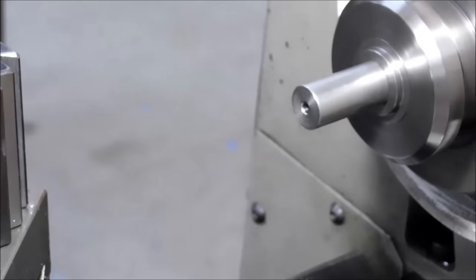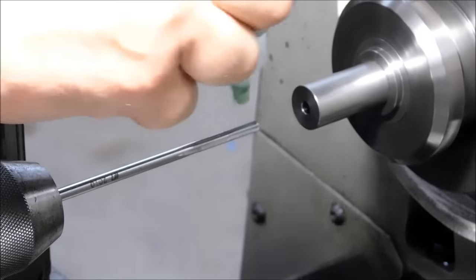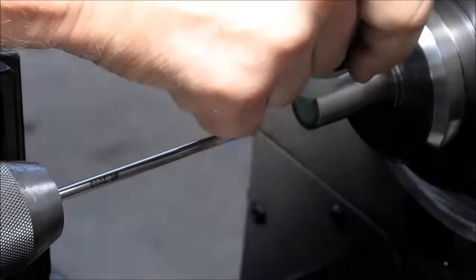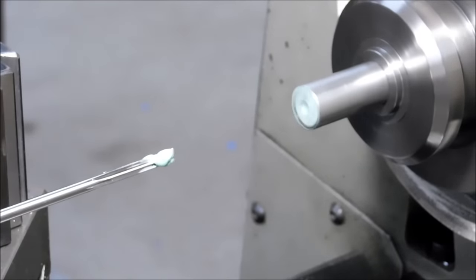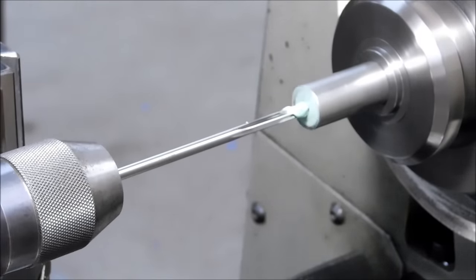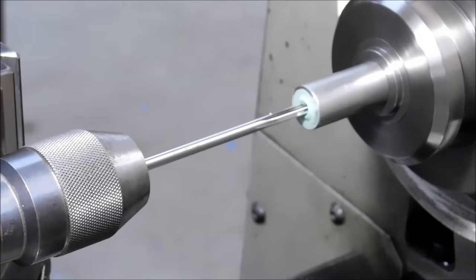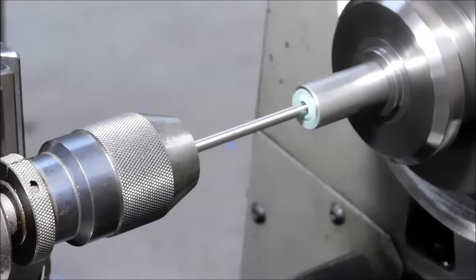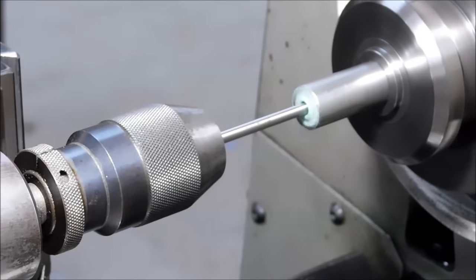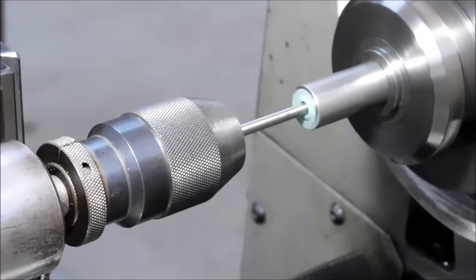That's the moment of truth. When those holes break through, if one hole doesn't line up with the other one, you're going to start cutting on an eccentric on the other lead side, and it's just going to ruin your day when you feel that bumping going on in the handle. And to finish it off, float the reamer back through it. You don't have to go all the way through the part. Go to the parting line, maybe a little bit further, and just pull it back out.